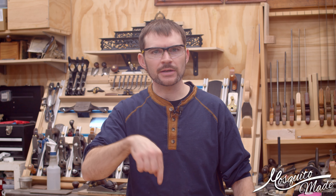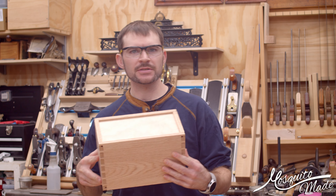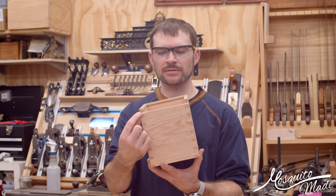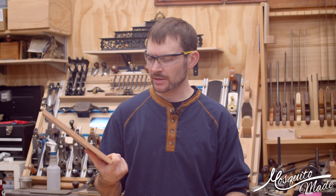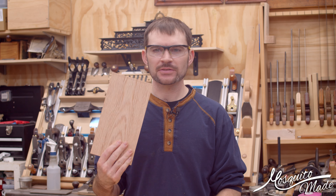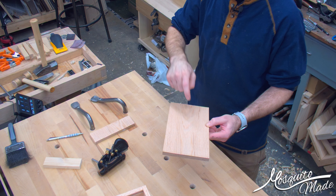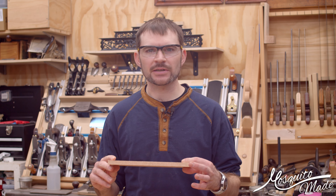Welcome back — today, now. Some things I did before I started shooting: I just cut a little piece of plywood and threw it in the bottom. Cut the front so it's just below the groove. This was actually the piece I had cut as a spare and then screwed up — it was supposed to be the good one — so I cut it a little shorter and now this is going to be my new lid. I'm going to cut a rabbet around three sides, do a little finger pull, and probably bevel the top to make it look almost like a raised panel.